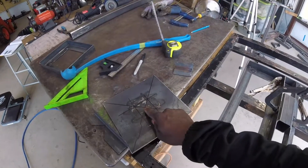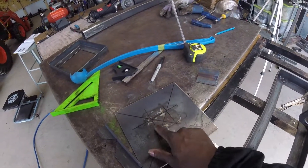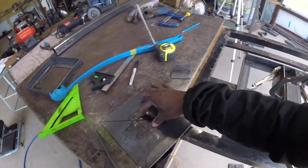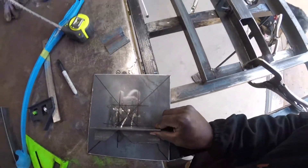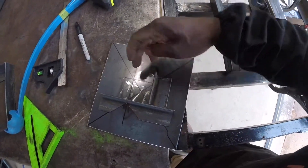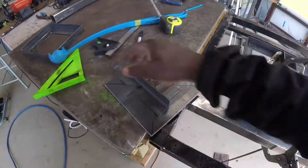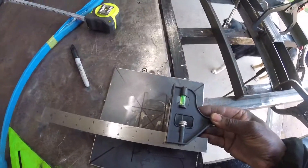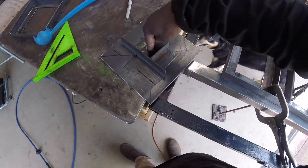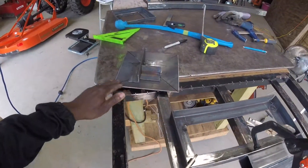This right here is going to be the top plate. What we did is cut across here, found the center, then went an inch on each side of the center — that's a two-by-two square. Put an inch on each side of the center and inch all around, and that'll come out to a two-by-two tube there. We're going to clamp that, and when we get to weld that end we can put the two-by-two right there and we'll know this corner is square. With that being the reference, we'll know we're in the center. We'll probably have to clean some more mill scale off because I'm going to have to weld that.